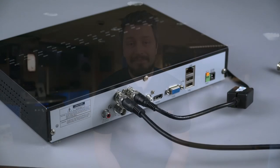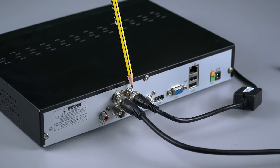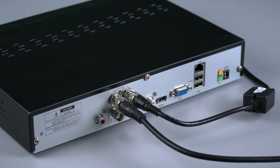In a multi-camera system connected to a single DVR, there is still a chance that ground loop interference can spring up on more than one video input. A Humblock connected to one video input may reduce hum bars across the whole system, but unwanted currents flowing from other video inputs on the system can still cause issues. For the best results, I'd recommend connecting a Humblock to every video input on the DVR system.